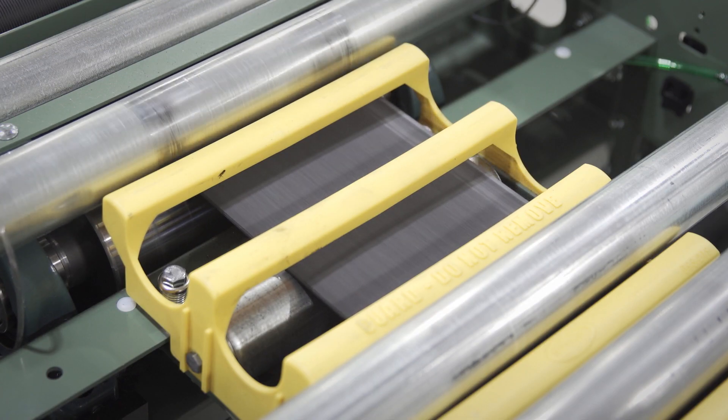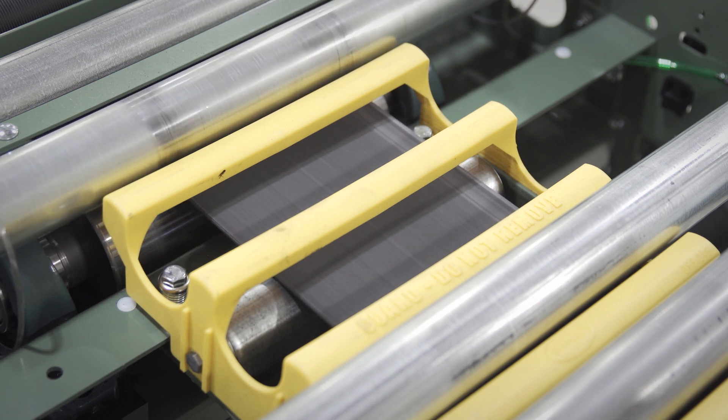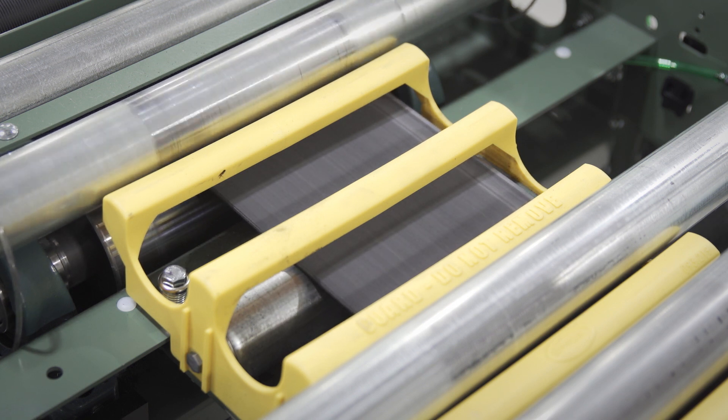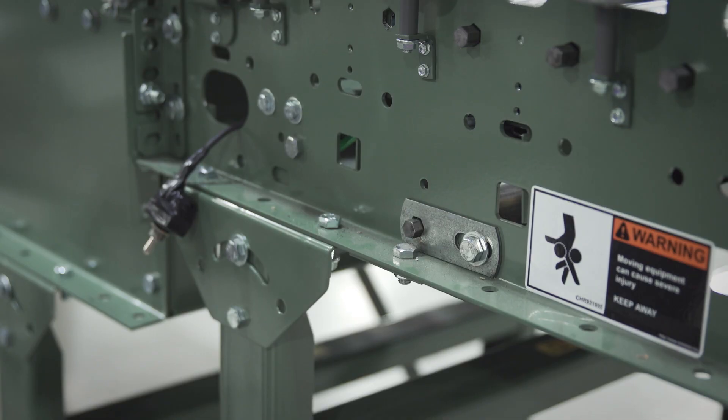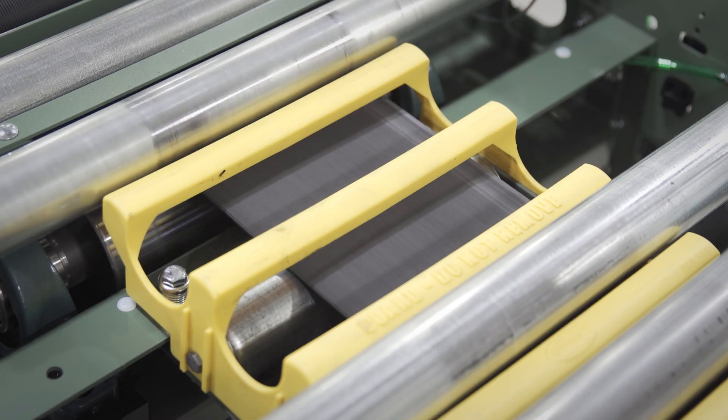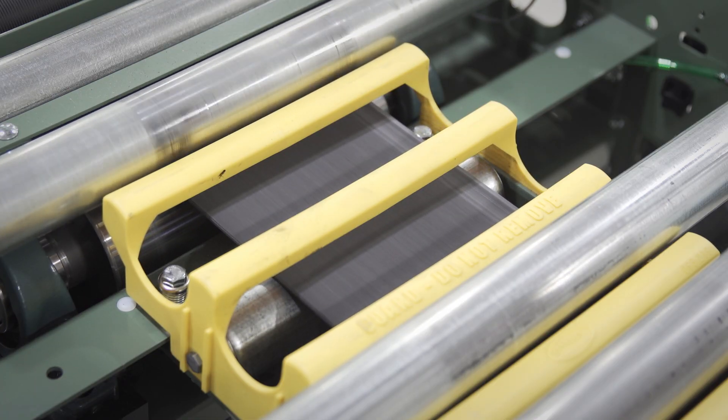As a belt under model, the rollers will be rolling one way with the belt running the opposite direction. If the belt is drifting toward one specific side, move the snub idler nearest the discharge end on the opposite side toward the feed end of the conveyor.